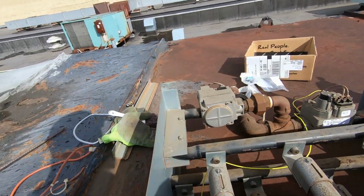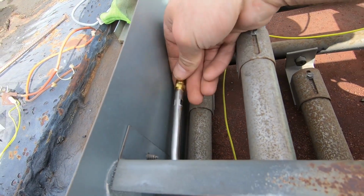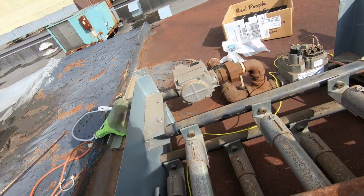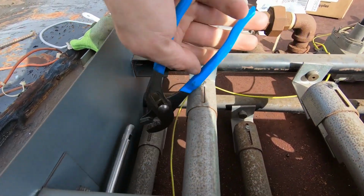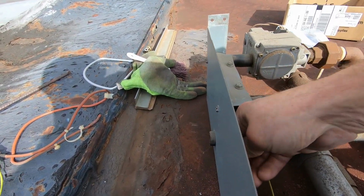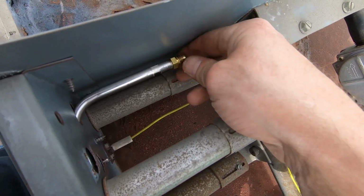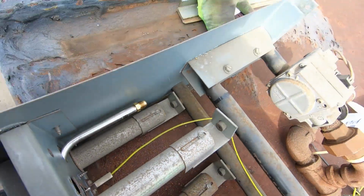Next thing is the orifice. A lot of times they're just loose in there. So what I normally do is I take my channel locks and I just slightly oblong it, so it's not a perfect circle, and that'll hold your orifice in place. Now, as you can see, it's got some resistance and it's in there, but it can still spin and it's not gonna just pop out.